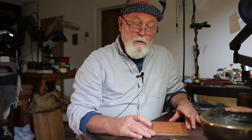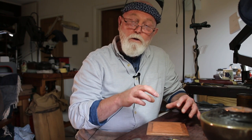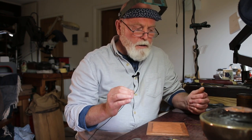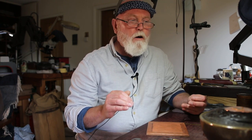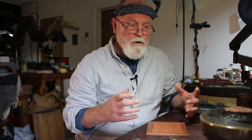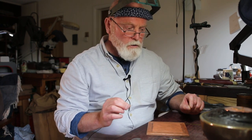This episode is about raising the lip that will hold the mongane, the ginkgo leaf, in place. I think it's helpful to think of metal inlay of this type as setting the inlay, rather than creating a cavity and then forcing the metal in. I think that's a misunderstanding that often bedevils people's attempts at inlay. So I'm going to demonstrate the basic principle using plasticine and a larger model.